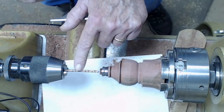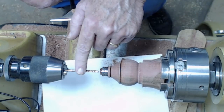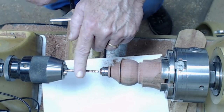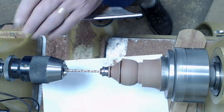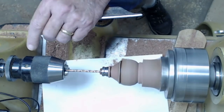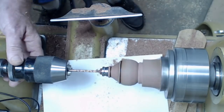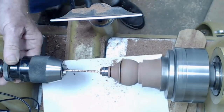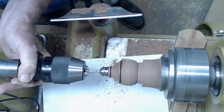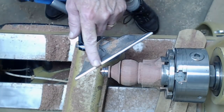I'm going to drill a hole one and a quarter inch deep, and I'm going to use the drill bit that matches the size shaft I'm going to use. Sometimes we get lucky and we can just tap that in without any additional glue. If it's a little too snug, you can always go up a 64th. We're going to set the speed at about 1,000. I'm going to let it just find the center, going very, very slow so I get a nice true hole. Clear the chips regularly. Now we've got that drilled. I said we're going to cut that tip back to a sixteenth of an inch — let's go ahead and do that.